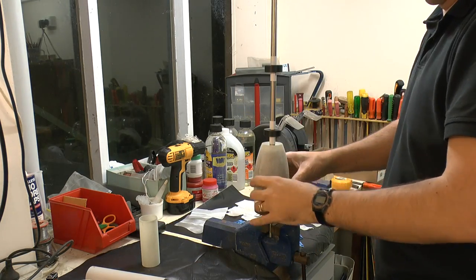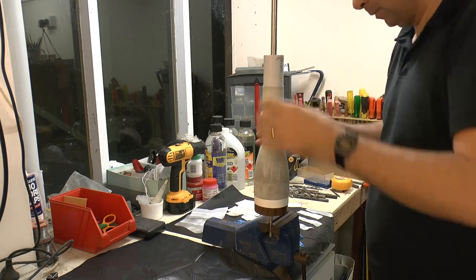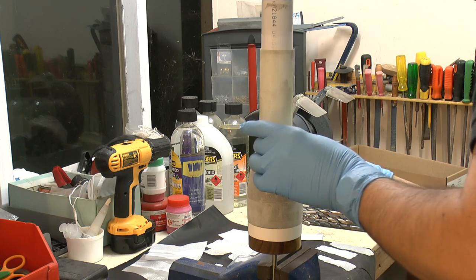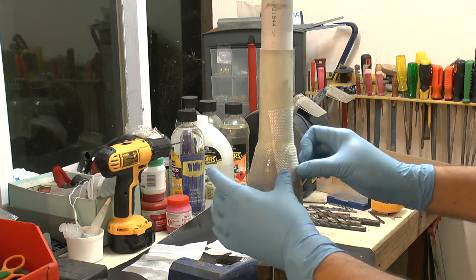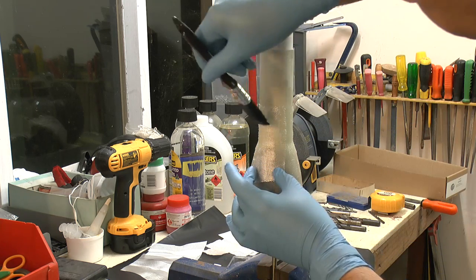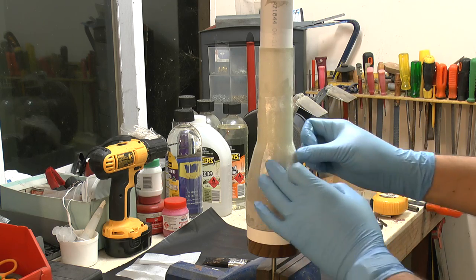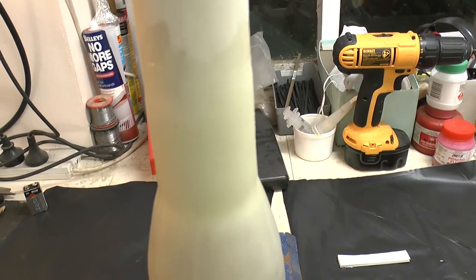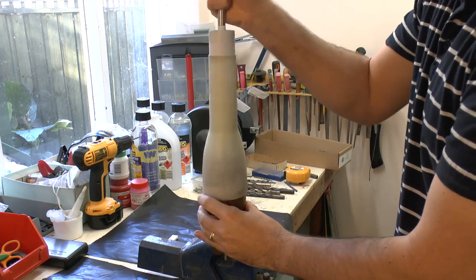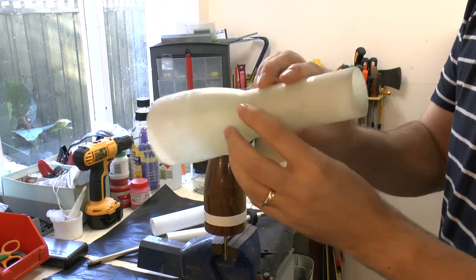We machine up some centering rings for the pipe, then insert the pipe with the centering rings. We put the PVC pipe over the top, some baking paper to prevent sticking, and the motor mount tube over the top of that. We apply some epoxy and strips of fiberglass over the joint — some small ones all the way around and longer ones to hold it in shape. Finally we use 85 GSM cloth for a better finish. The next day it's all cured — we pull out the central core, the tube and the paper. There it is, ready to be glued to the back of the rocket.